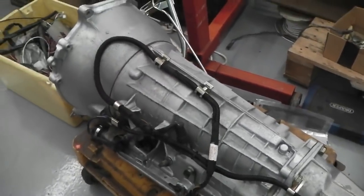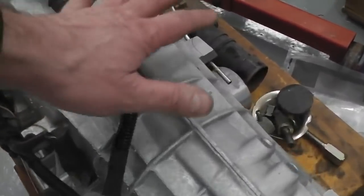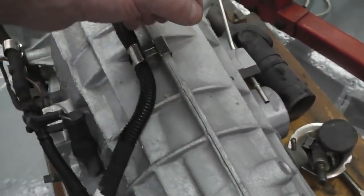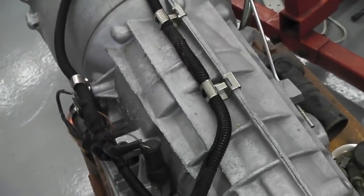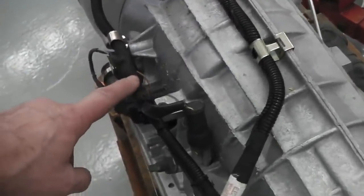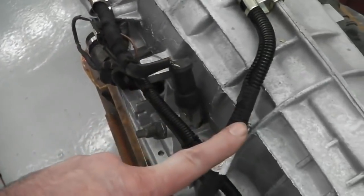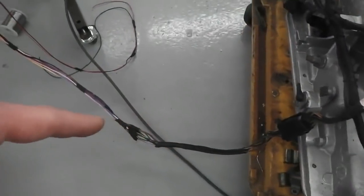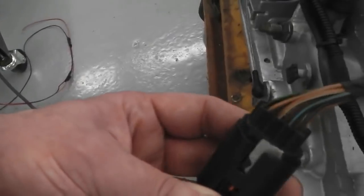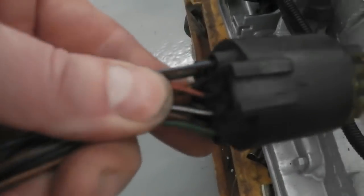If it's an electronic one, like that map sensor I just showed you on the bench, we could fit it on the side of the engine out of the way, then just have a separate harness, only 3 wires. In fact, it's crazy really, because it could pick the 12 volts up off here. I've already got 12 on board, I've already got ground on board. It's a shame there's not one more cable, because I could have brought that extra cable up, but I don't think the multi-plug has enough. I don't think there was a spare on this. If I recall, I've used all these cables.